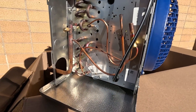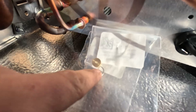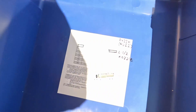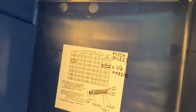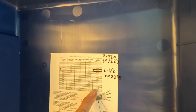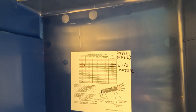Looking at the actual evaporator, they send two little orifice bits — a one-half and a three-quarter — that go into the distributor. You have to look at the side cover to figure out which one to use. Look at your model number; in our case it's 0095 after the CEL. You look at the chart, go down to model 0095, and then for the R22 column we're going to use the L one-half. If you can find your refrigerant and valve type in one of the columns, go down and use either the three-quarter or half according to that chart.